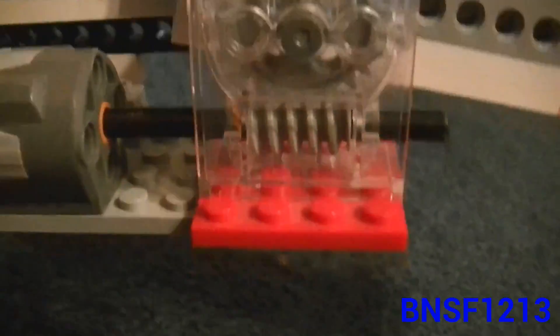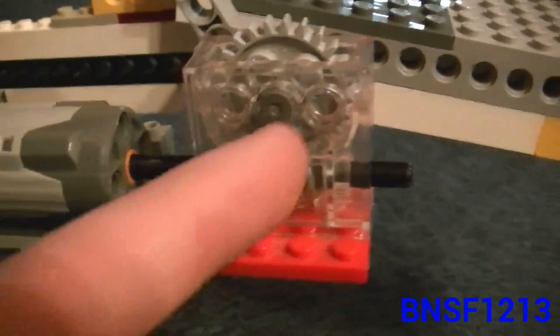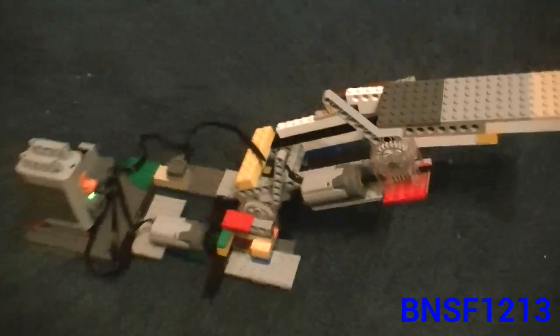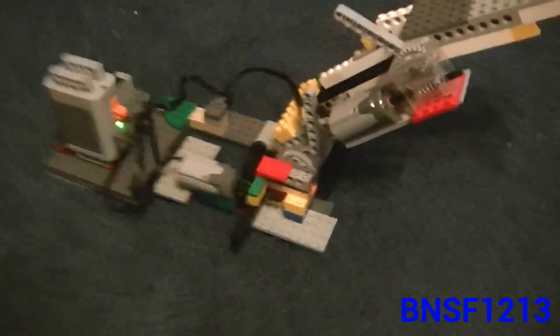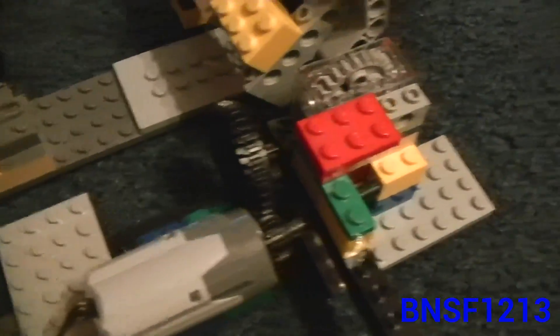I have this motor and this motor. They both power a mechanism where this corkscrew spins and turns this gear at a slower rate than the actual motor turns. The first joint is at the bottom — you can see it goes up and down. This one was still too fast, so I hooked a small gear to it right here and then a larger gear to it, which slows it down, and then it goes to the same little gearbox.